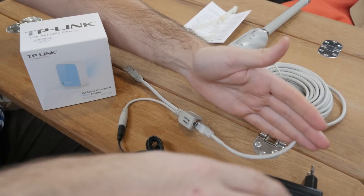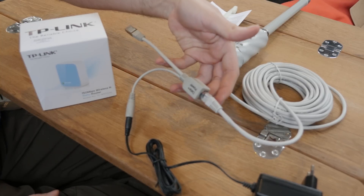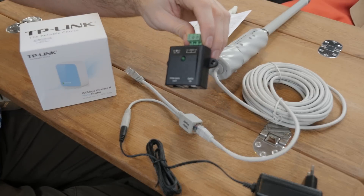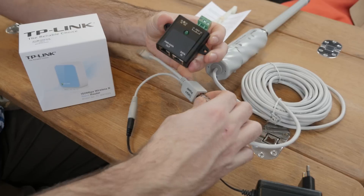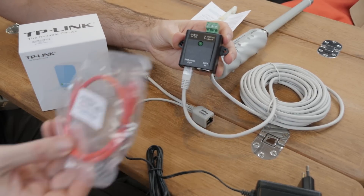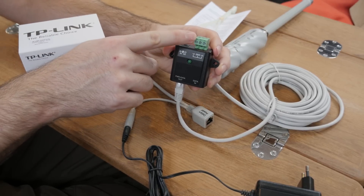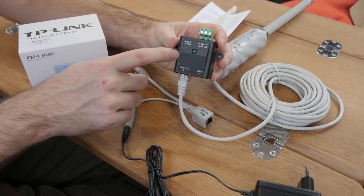In the final setup I won't use the PoE injector — I'll use this instead, which will allow me to power the system off the boat's battery. It's easy to hook up: take the Ethernet cable from the Groove and plug it into the 'power plus data out' port, then take a separate Ethernet cable to hook up the 'data in' connection port to your router or access point, and hook it up to your battery. This thing supports a wide range of voltages, so it's very well suited for use aboard a boat.